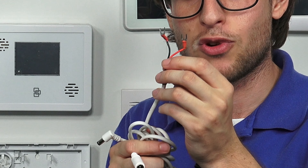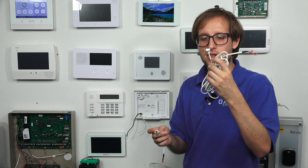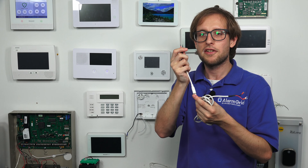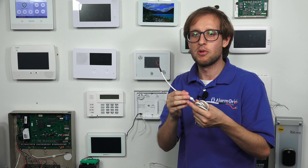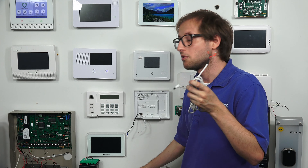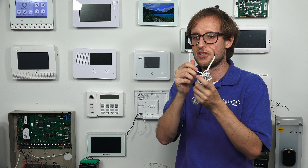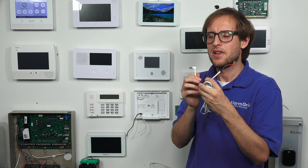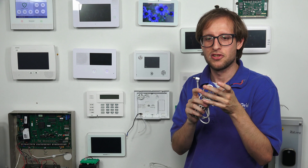When preparing wire, you will need a wire stripper. We have one here — I'm not going to demonstrate it on camera, but I'll show it. The wire stripper has markings based on gauge that you use to insert the inner wires. There's an outer shield and inner wires inside, and you strip the covering off the inner wires to reveal the copper. For a 22 gauge wire, you'd insert it into the corresponding hole and pry the covering off. You'd first remove the outer jacket to reveal the four inner wires, then strip them one by one.